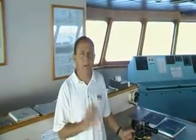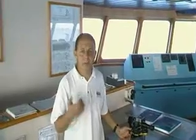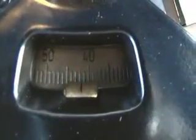How you get your time is up to you. If there's two of you, you can have someone with a watch and just tell them when you're happy and they can log the time. If there's one of you, you can count elephants, or 1,000, 2,000, 1,000 Mississippi. Get back to the chart table, get your time noted down. Then you've got to read off your sextant reading. Okay, so you can see from that I've got a reading of 41 degrees 35.8.